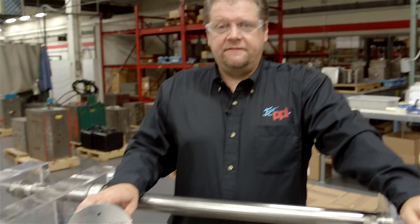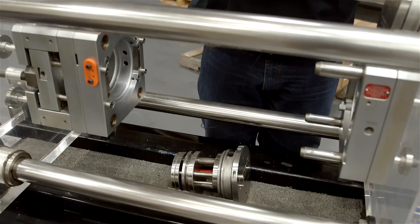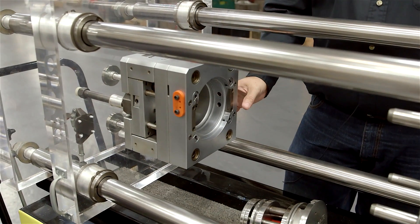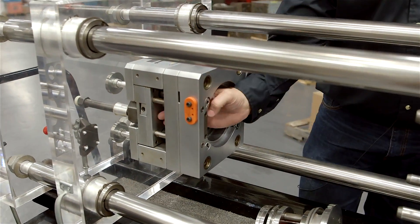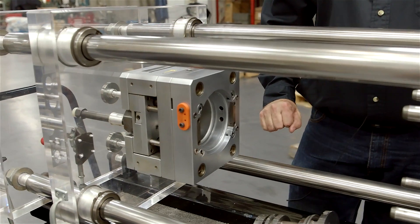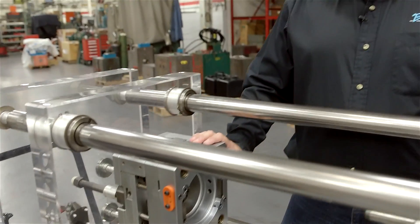The concept of Roundmate is really very simple. Instead of buying all of the steel that's included in a dedicated mold, you're buying a master frame that stays dedicated to the molding machine and simply purchasing cartridges that fit into that. The Roundmate system has full guided ejection, so you're never buying that over and over again. Guide ejection bushings, return pins, full leader pins and bushings are included, and the base is 420 stainless pre-hard that's also chrome plated for durability.